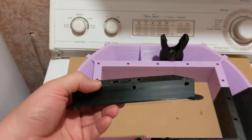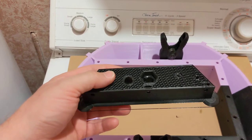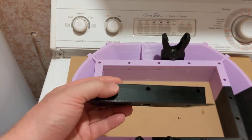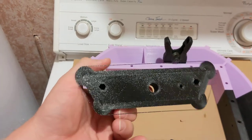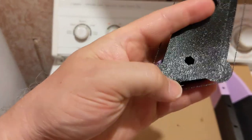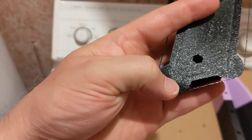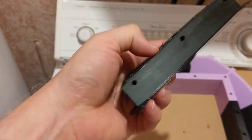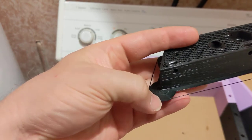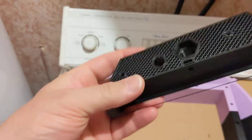Drive A, I have the large motor frame, and then also for drive B here I have the large motor frame. Now that's the big piece that holds the motor, and I've tried over and over and over and can't get it to print. It lifts off the bed. This one looks like it was just barely starting to lift a tiny bit in this corner. After it had printed for about an hour, I threw blue tape across all of these helper discs at an angle in an attempt to hold it down.